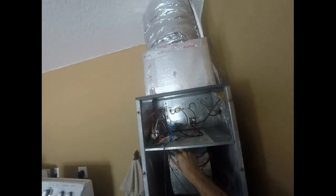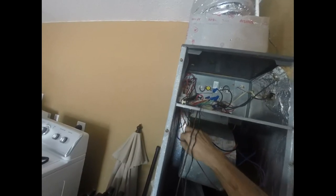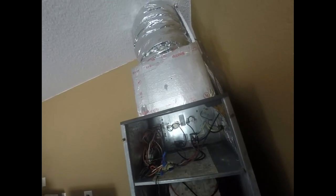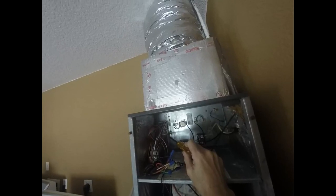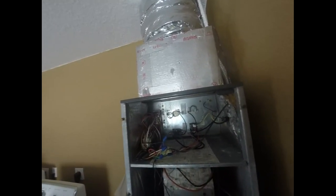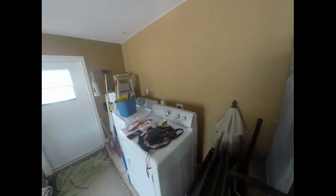We've got the blue wire disconnected, so we'll get it fished down here from up above. You'll see that the black and the red wire are right here on the control boards — these are just terminals to park them there, so they're just not dangling and hanging out there in the blower compartment. There's no connection whatsoever.